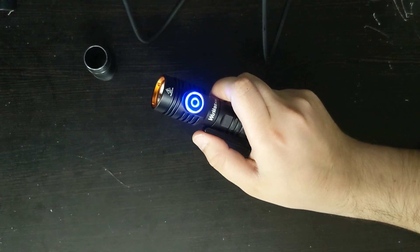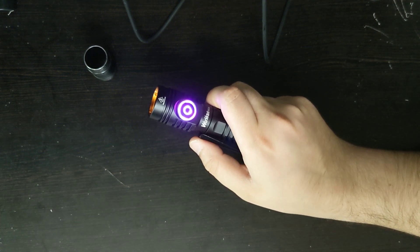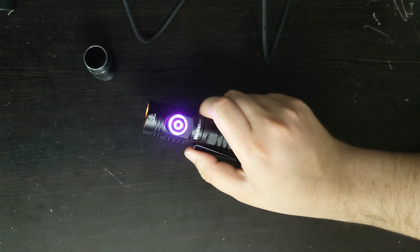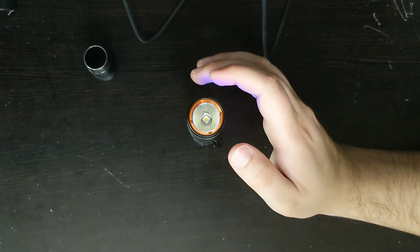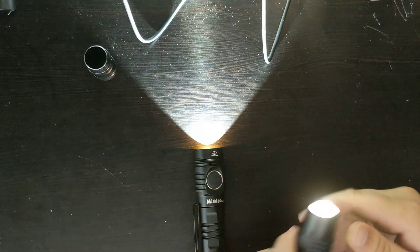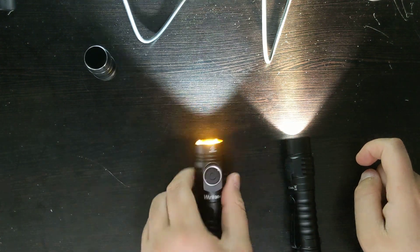The SFT-40 is a little bit cheaper, but the reason I bought it is really because of the good throw and spill it provides. At a lower level, it still provides decent range — using less battery but able to provide more light, much better than the XHP50.2. However, the XHP50.2 is probably more impressive in the higher turbo modes. If you're looking for something to keep a strong light at lower levels, the SFT-40 might be the better option. I'm glad the SFN-43 is discontinued. The throw is pretty decent on this light, and compared to the FC-11, this has a better angle — I think because of the orange bezel.